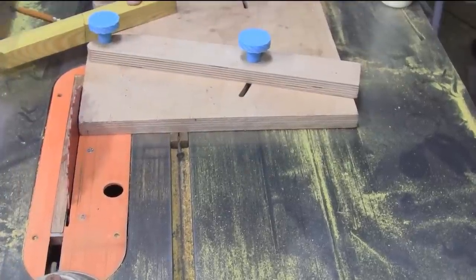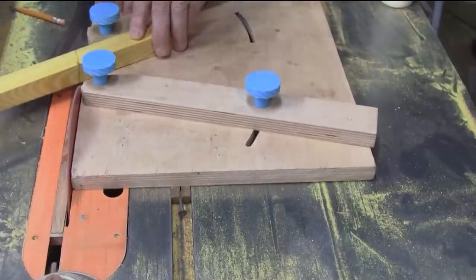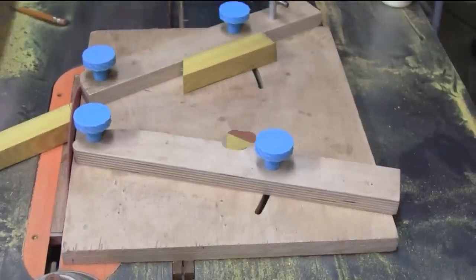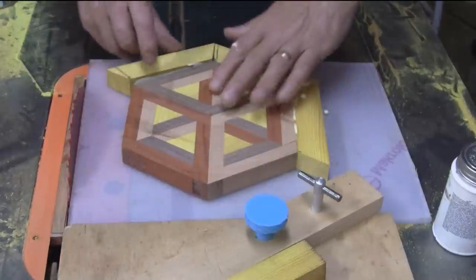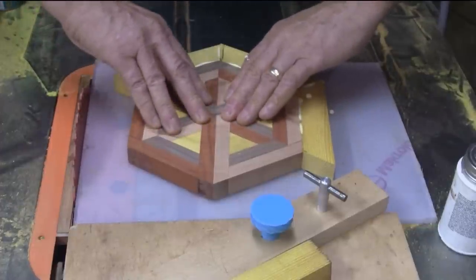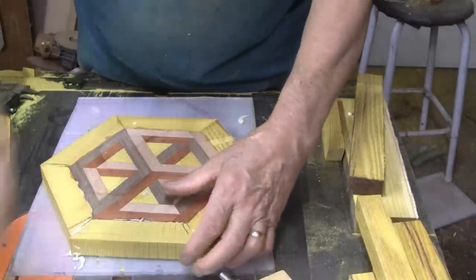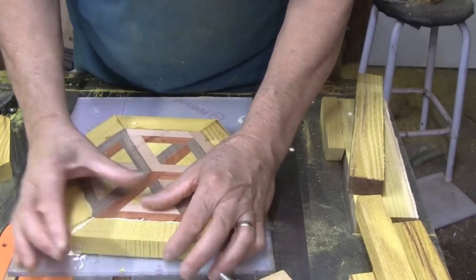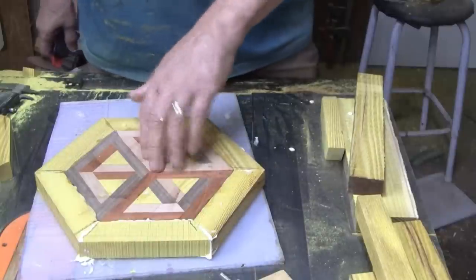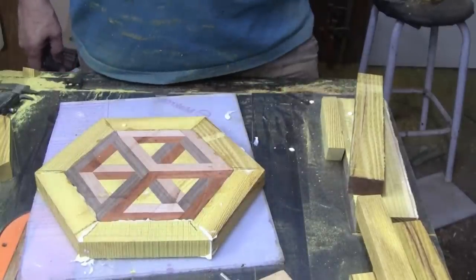The body of this illusion has six sides, which makes it a hexagon, and I'm now cutting six segments that will frame it - those are trapezoids with the exact same angle as all the rest of the pieces. I cut five of the pieces to match my drawing and left one piece long just in case I needed a small adjustment, which I did - took a little off and it fits. I'm going to let this sit until tomorrow and we'll get some segments on here.